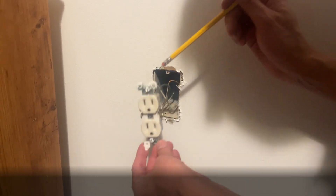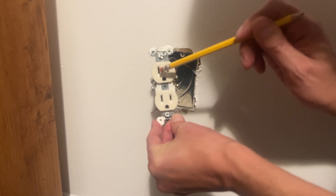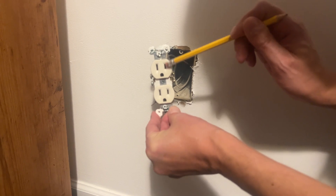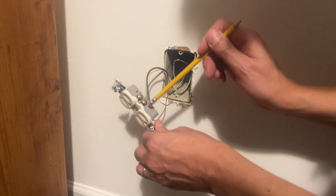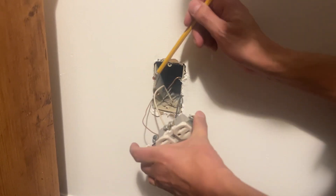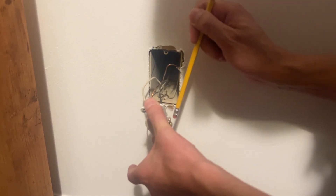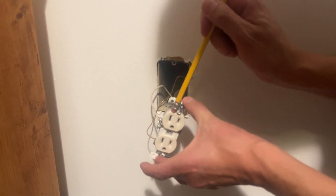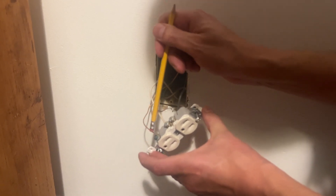These connectors come in two all the way up to five configurations, are safety UL rated, and make working on electrical circuits a lot easier. Connecting to the wrong side of an outlet: when you look at your outlet, they're polarized — one side is larger than the other. The larger slot is the neutral, the thinner side is the hot. Your black hot wire always goes to the gold colored screw and your white neutral always goes to the silver colored screw. It is required to have that polarity correct, otherwise you'll have a defective outlet. Always connect the ground, if available, to the green screw.